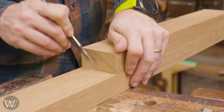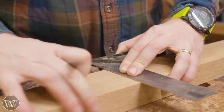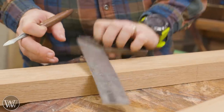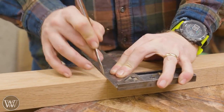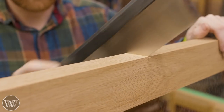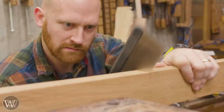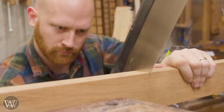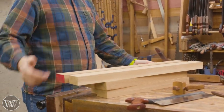Next I want to mark them to length. For each of the feet, I made one and I'm going to use that as a template to mark off all of the other ones. And then the same thing with the back verticals — I made one and I'm going to use that to mark the other so they are exactly the same length. That way I'm not marking to a specific measurement, I'm marking to reality. Mark all the way around the board and then cut it down. I'm going to be using a carcass saw to do most of the cutting on this crosscut and it works relatively quickly. Making faces is incredibly important — it actually helps quite a bit.